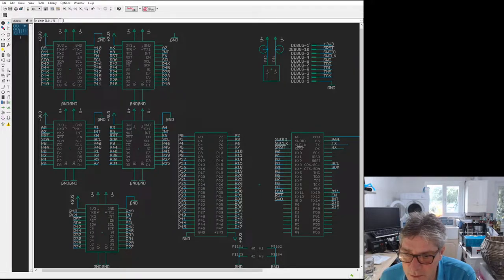Before, these signals were the EN, INTs, and RSTs, shared with the debugging, but of course if you want to use them, then you couldn't do the debugging at the same time, which I didn't want to do this time around. That's what we have on the current MX carrier. So here I freed those up for their real jobs.